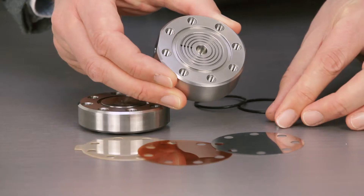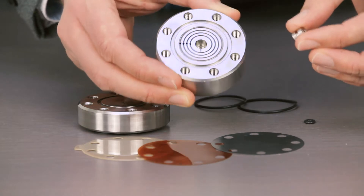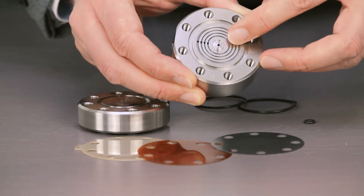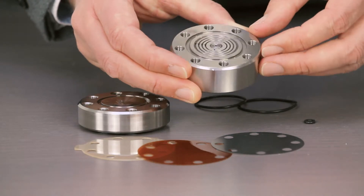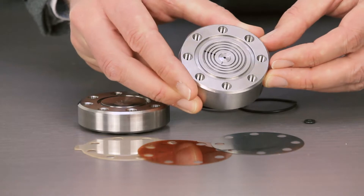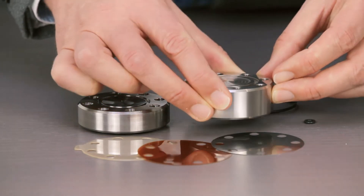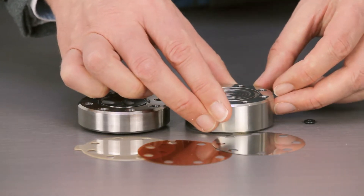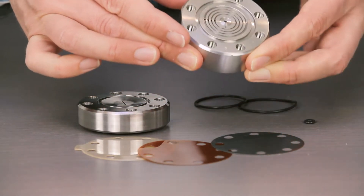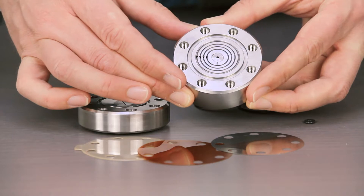As you can see here, it is made out of a stainless steel body and an insert that has a slightly conical shaped edge. In this case, in contradiction to the ZF series that we already explained in the other video, the diaphragm seals directly on the conical shaped orifice.